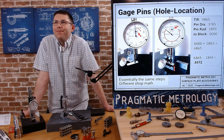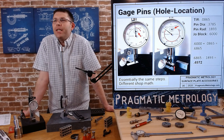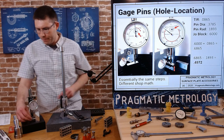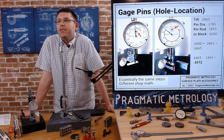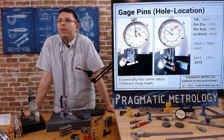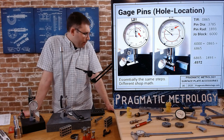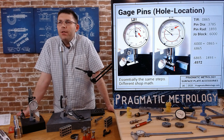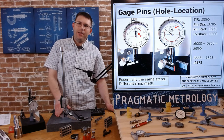About five minutes ago I should have used my calculator to figure out the radius of the pin. I calculated the radius wrong - I tried to do it in my head. Obviously I did not do that correctly. So actually, if you do the math correctly, both pins end up at the same. If you plug in 0.189 in my previous calculation, it should get around 0.497 or 0.498 just as this one's showing. I had 0.194 written on the whiteboard and I should have wrote 0.189. I apologize for that - when we do the practice exercises I'll make sure to do it correctly.